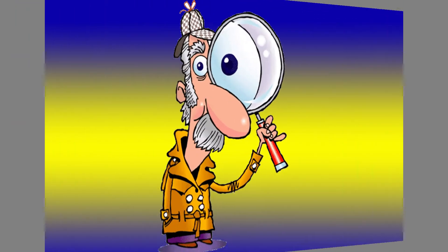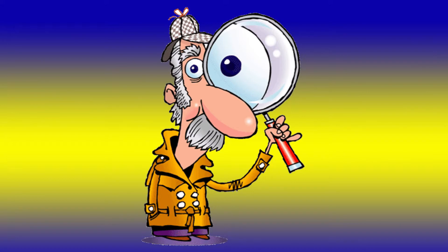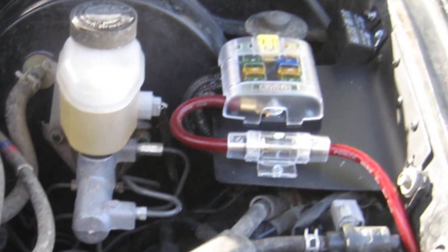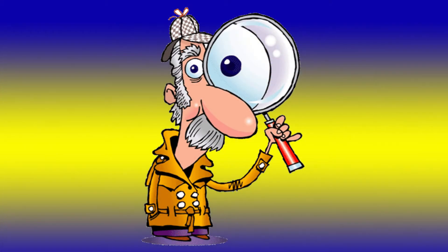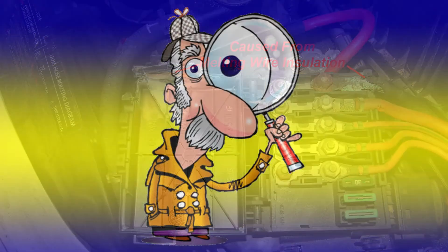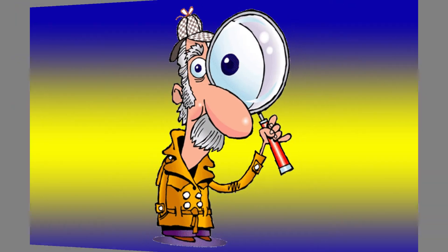Regardless of your connection type, inspection of all the wires and fuse holders should be carried out at least once a year. This may require removing and reinserting fuses in their fuse holder. This is especially important when using tubular fuses, whether in spring-loaded or in-line holders. The inspection should also include looking at discolored parts, which might indicate a loose connection or overload condition.